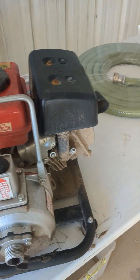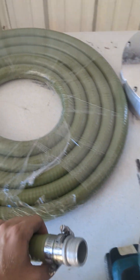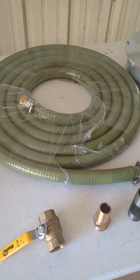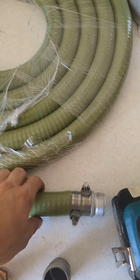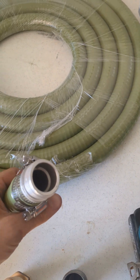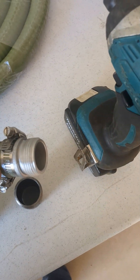For your hoses, you're going to want rigid hoses on both sides — your input and your output. The reason for that is if you put a soft hose on that output, it's going to be extremely difficult to control. The rigid hoses are just better able to handle the oil and they don't biodegrade as easily. Those soft hoses I have found break down pretty quick.